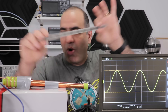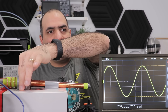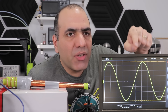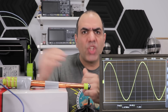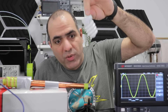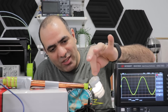Let's put my special core in. The frequency drops and the output rises. Now the frequency is around 1.85 MHz. So my core works — it increases the inductance by around double, reduces the frequency, and increases the output voltage. Let's use another lamp and see if it's brighter. Yes! It turns on earlier and is brighter.